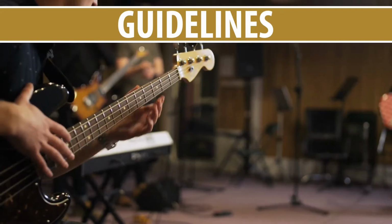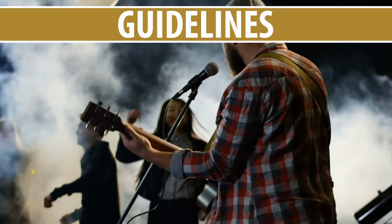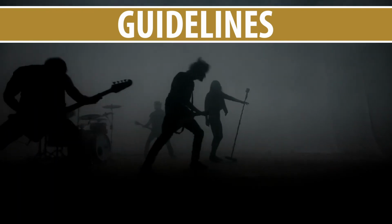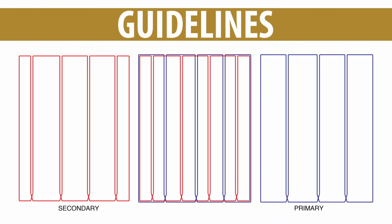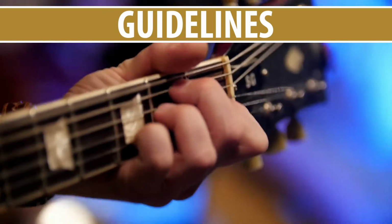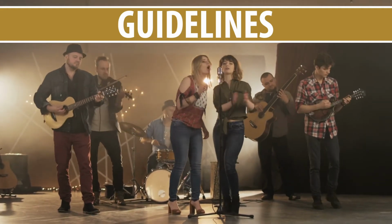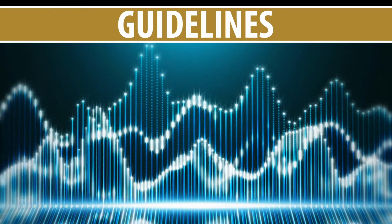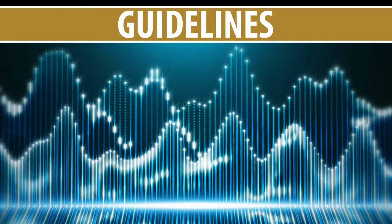Dynamic microphones and some musical instruments will pick up the loop signal and create feedback. Plan the loop so it does not extend into band areas. Phased array loop design, which will eliminate this issue, will be covered later in this video. The musical instruments can also be isolated from the loop system if there is a separate feed for the instruments on the soundboard.